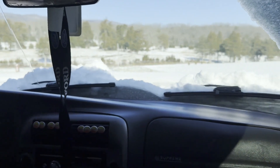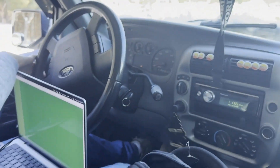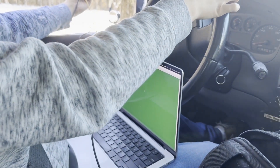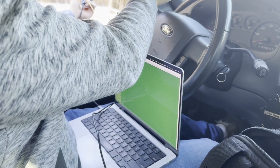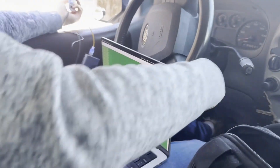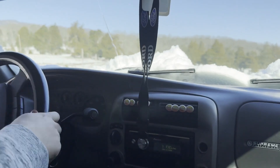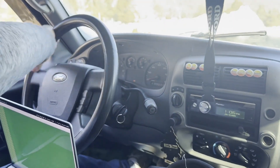Alright, we had it here earlier — barely. Let's see. The fact that I even got a ping is enough for me to call this a success, because that means we learned Layer 2 all the way back at the switch, a mile away. Also, the antenna is on the back of the house. Technically, we're facing southeast, but right now we are facing north, so the roof could be causing some attenuation there.